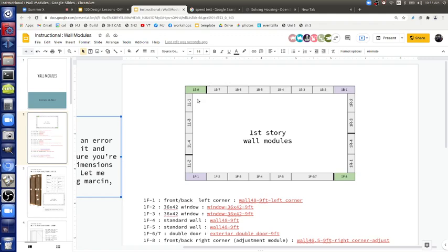An inch and a half each, or 3 inches total? Much more. It's the width of a 2x6. Yes. Right? So 5 3/4 each? 5 and a half, yeah. That's good. So they're 5 and a half shorter, meaning 42.5, not 48. So if you understand that piece, if you could logic that, you don't have your blueprints, you say, oh, okay, I know it's shorter by a 2x6, so you know that it's not 48, it's 42.5.